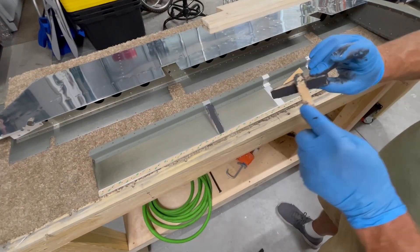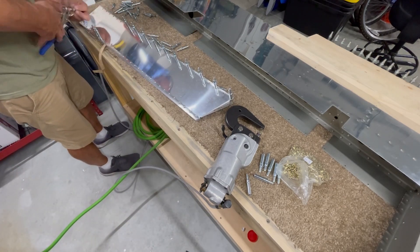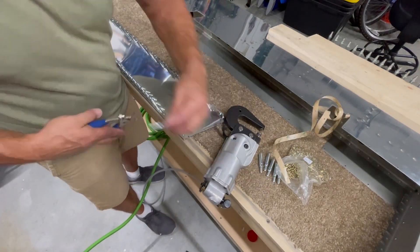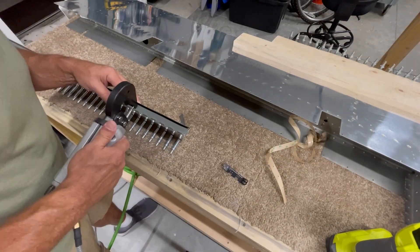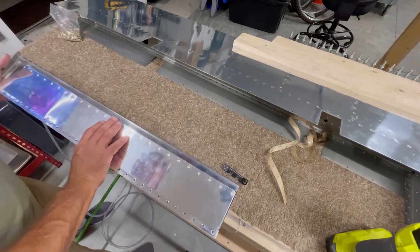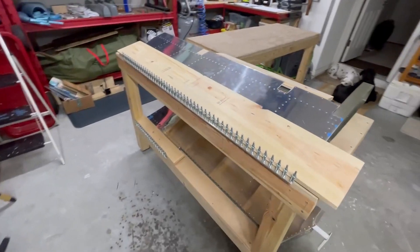For the trim tab, I open it back up and install the coated ribs. After I cleco the top back on, I remove the protective cover from the 3M tape on the top side a little at a time as I cleco the trailing edge of the top skin in place. And then finally I rivet the leading edge of the top skin to the spar. The trailing edge and sides are left clecoed for now while the trim tab is turned over and has a weighted board applied. And now I let all that set up for a few days, after which I'll be able to close out the trailing edges.